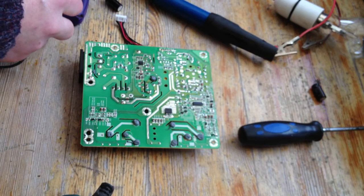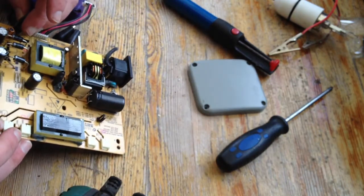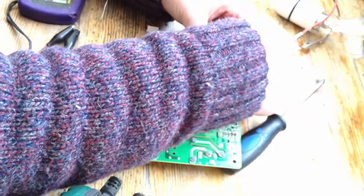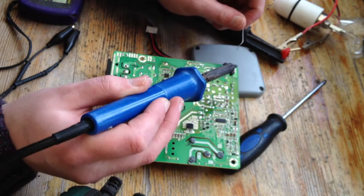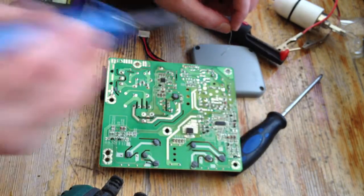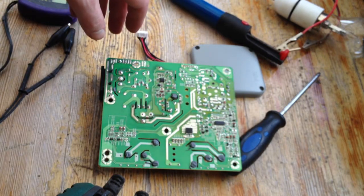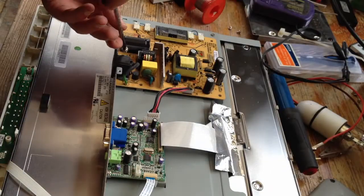We're going to replace both of them anyway — if you see any with bulges, you're better off replacing them. You can pilfer capacitors from old boards quite easily. The two I'm using are secondhand ones; I generally keep a stock of power supply boards and take the good capacitors off them. Use your ESR meter to verify they're good. When installing, make sure the polarity is right and that you're putting the correct capacitance and voltage rating in the correct position. I normally take pictures beforehand so I can verify afterwards. Once soldered in place, I leave something underneath to put pressure on the capacitor so the leads are forced through the holes properly.